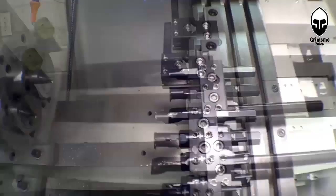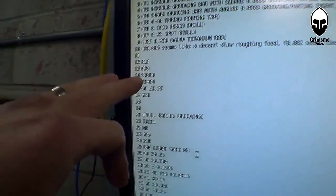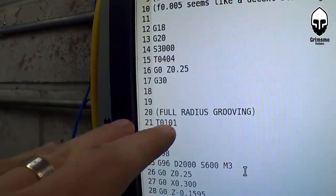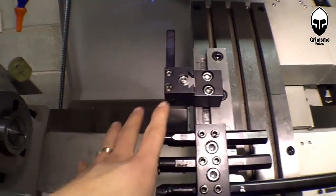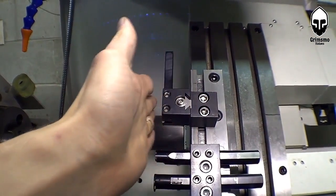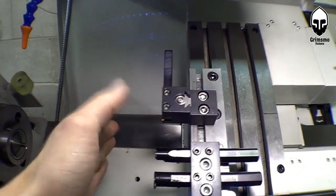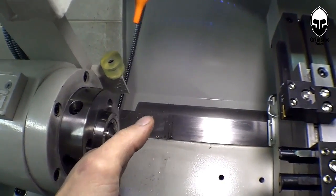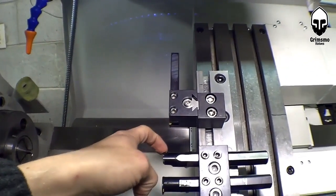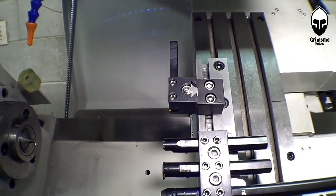I figured out what happened — my mistake in the code. So it went from having the stock right there, to the tool moving to the home position, and then it chooses tool one and moves to Z25. So from roughly this position, it chooses this tool — you see how it's stepped back like half an inch? — and then it moves this tool to 0.25, which basically puts these right in the way, and then it moves the X down into that position.